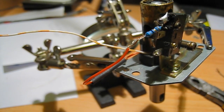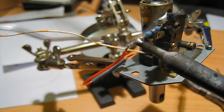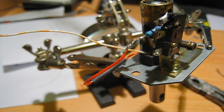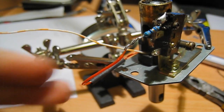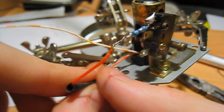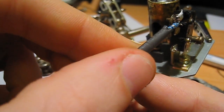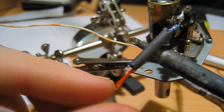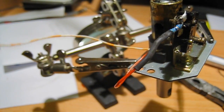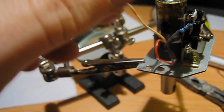Clean the tip of your soldering iron, then apply some heat and melt some solder onto there like that. Then once you've done that, put your piece of heat shrink tube onto there — try not to cover the resistor up, just like that. Then use the side of your soldering iron to shrink down the tube.